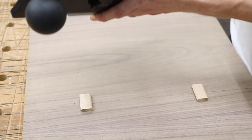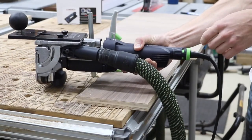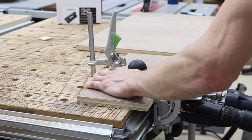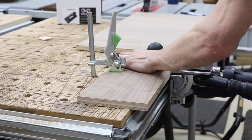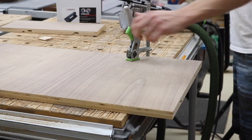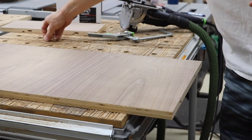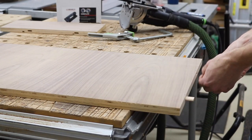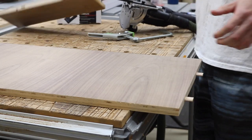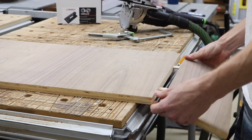I'm going to make an adjustment to my depth and get going. Just before we make the plunge, even if you aren't using the domi plate, I like to hold the domino at the back here — it gives a little bit more stability.